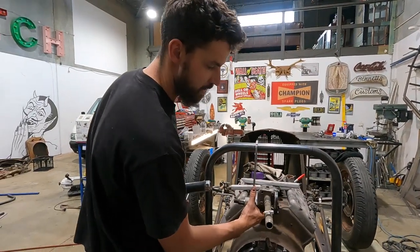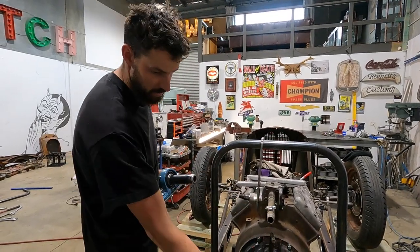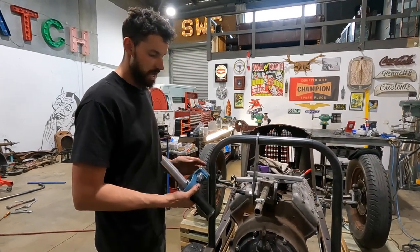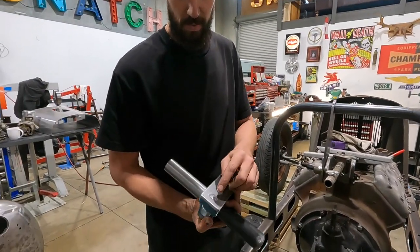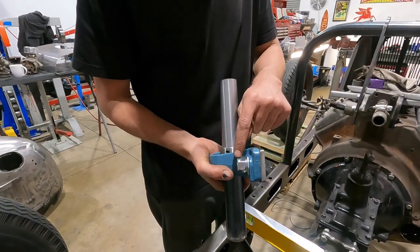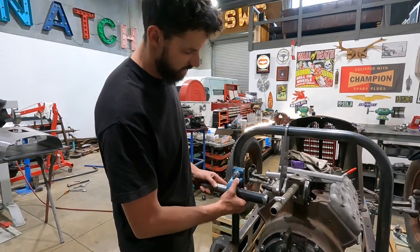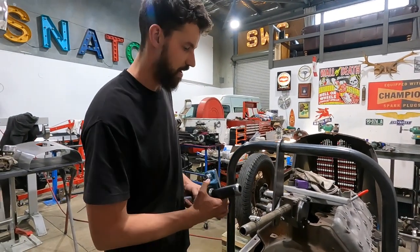Try and get that center. I know the pitch down to the torque tube up to the center here. I know where that's supposed to be. And we've just kind of lucked out with the pillow block. What I did was I actually welded in the bolts. So now there's nothing on this backside, so I can actually get pretty close on the side of the pipe.